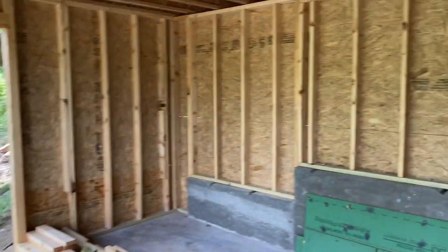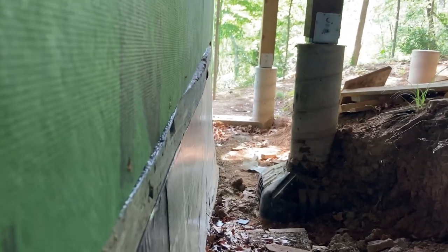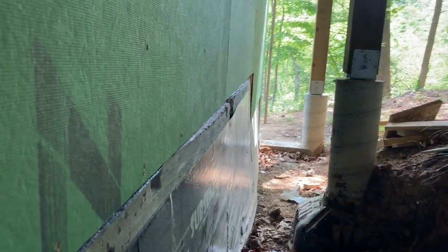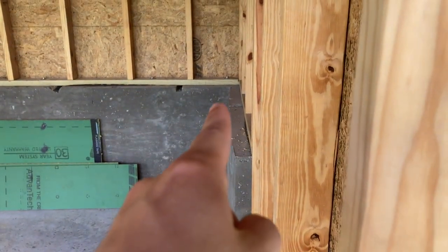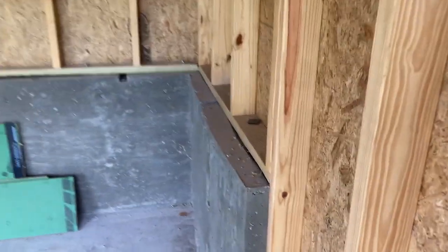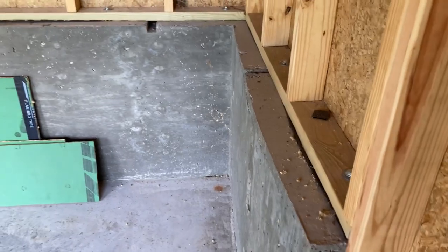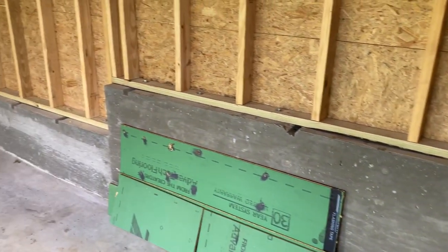We were able to get these three walls done — turned out good. When we poured these concrete walls, we almost busted the forms; the walls got kind of messed up, they were bowing and buckling, but they held together. You can see how much it's sticking out over there where the concrete wall is, but it shouldn't be an issue — you'll never notice it back here. On the inside you can see this wall is bowing a little bit too. The way I framed this I pushed it back, and we'll eventually come back and do some kind of tile or stone along here with a top cap of stone, and it should make it all just blend together.